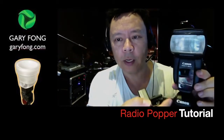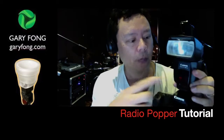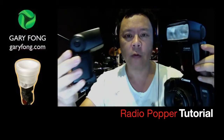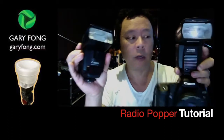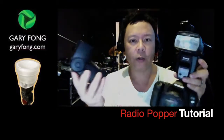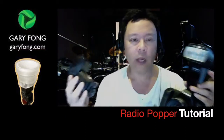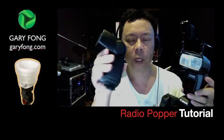What it does is it receives a pulse from this guy and broadcasts out a radio pulse. This is infrared — and infrared requires line of sight because it's light, meaning these two sensors have to be pointed toward each other, which is really tough to do. And outdoors they're not going to see each other at a distance. Radio, on the other hand, goes around corners because it bounces off walls.